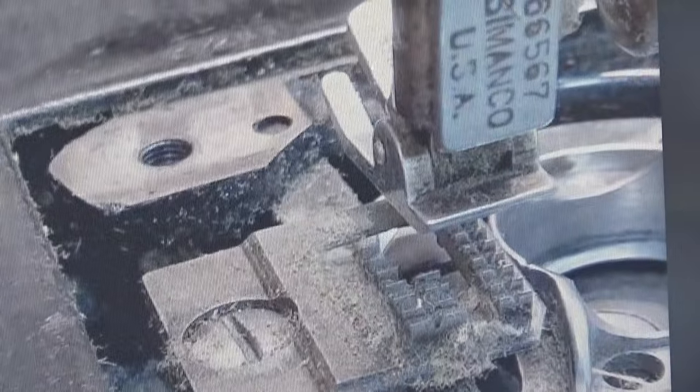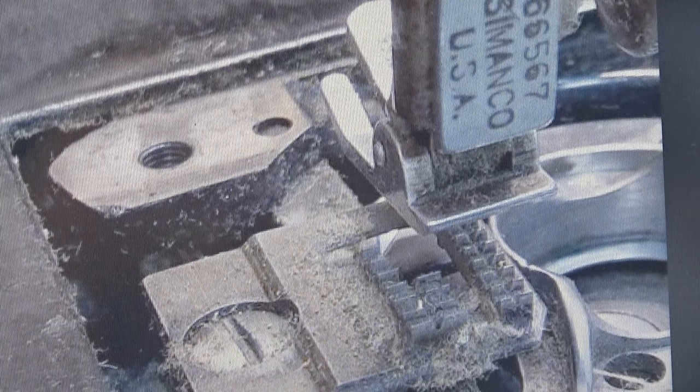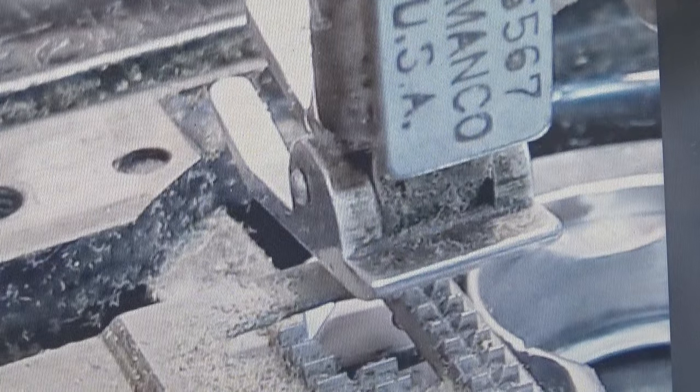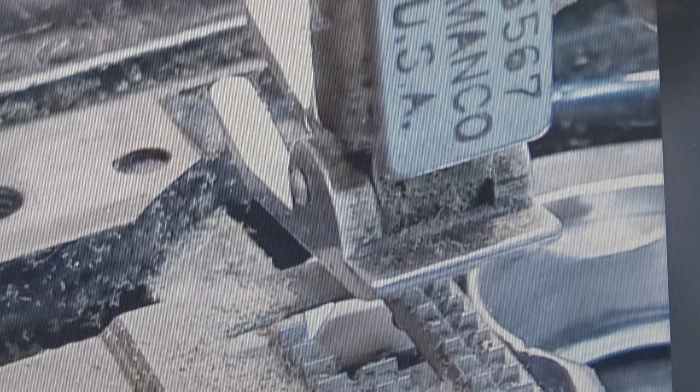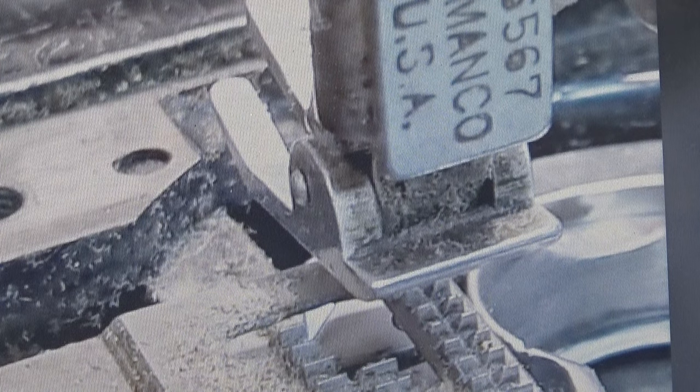Once again, I'm used to seeing dirty machines. I've been doing this for a long time. But with a machine at this level of neglect, when you have buildup like this, like you saw on those inner worm gears in the rear of the machine, it stresses that motor to a point of literally killing the motor, which is what happened in Chris's case, even after I made intervention.